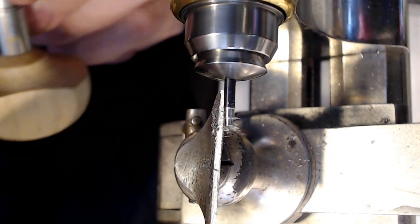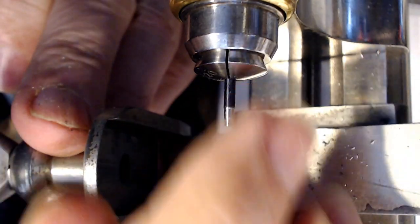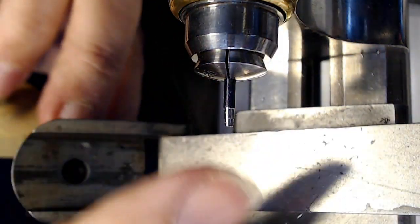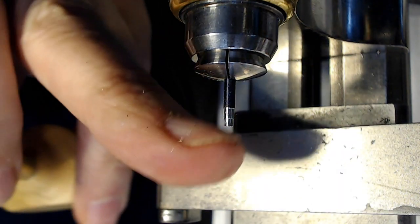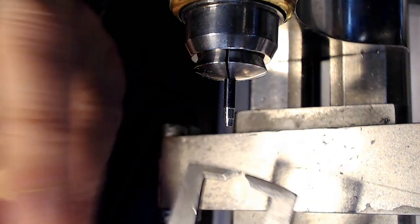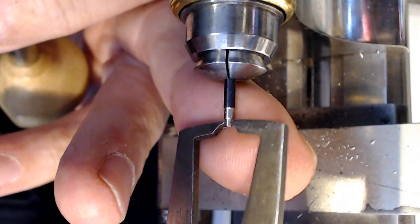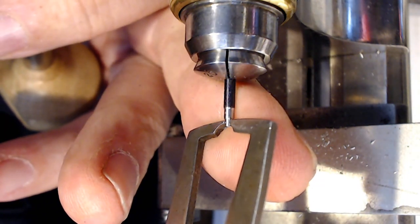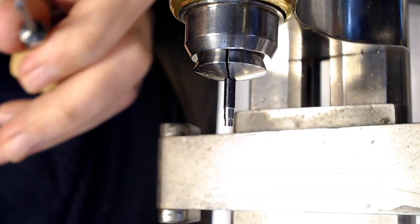I'm just sort of cutting this part down more than usual. Just cutting it down a lot to see, as long as the end part here is no more than the 12.2 I was telling you about, then I know where I have to go with the end, and then I've got to get a 3-degree slant on it. So normally I would cut it all down, but I'm trying to smoothen out that end part. And right now it's running at just over 14, so I don't have much to go.